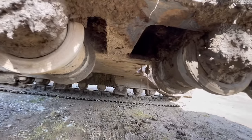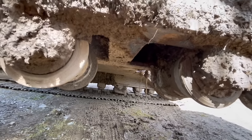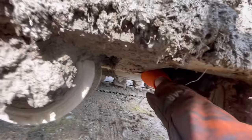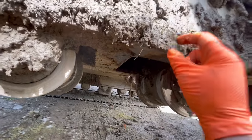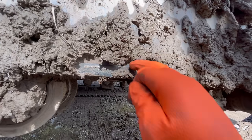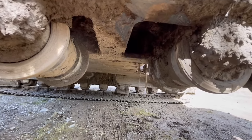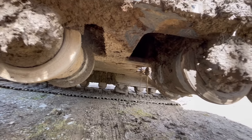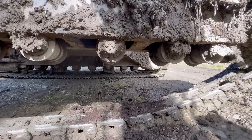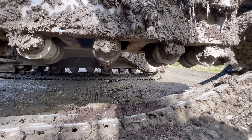Right, so we've got four out of four bolts snapped in. Remembering the last one, there was a stud sitting proud up in the track frame, but all four here are fairly flush, so the WD-40 and vice grips isn't going to work. I'm going to try with a sharp chisel to see if any of them move. The track sits low enough that it'll probably be just as quick drilling them out and running an M16 tap through.